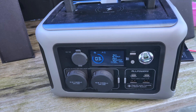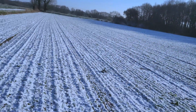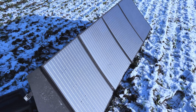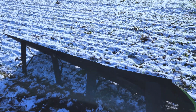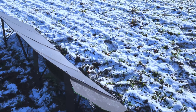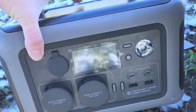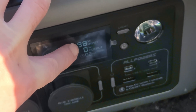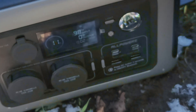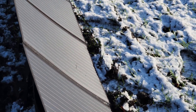With 2 watts, it would take around 99 days to get fully charged. The next day it snowed, but today the sun is shining as bright as it can get — I don't think there's a better winter day than this. I raised the legs of the solar panel so they're getting almost direct sunlight. However, it is still winter, so I don't expect to generate so much power. Even though it's freezing cold outside, I'm still getting around 98 to 100 watts. If the sun stays like this for about 2 hours, it will fully charge the battery from 11% to 100%. I'd say the solar panels are worth bringing with you, even in winter.